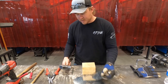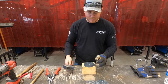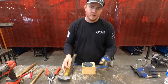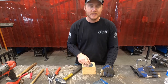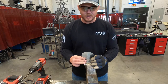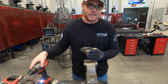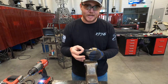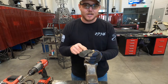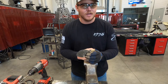This project should be no longer than an hour — I can usually bust them out a lot quicker. Next we're going to drill each one of these, and we are going to clamp them in the vise before we drill. This is sheet metal and it will get caught in the drill bit. These edges are now a little serrated, and I've seen kids go to drill this in their hand — it can turn this into a nightmare like a pizza cutter and gas your hands down to the bone if you're not careful.